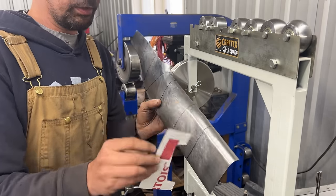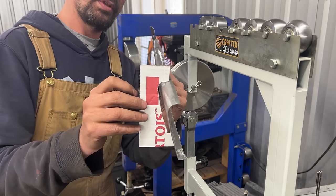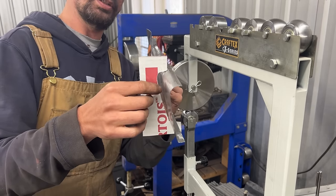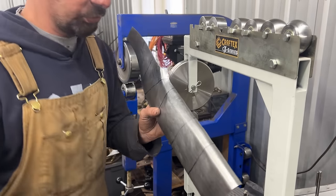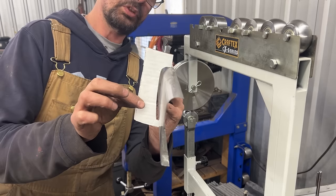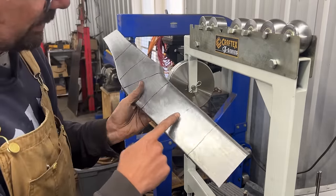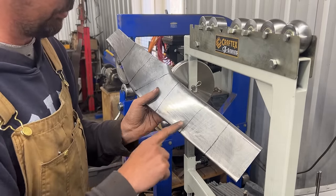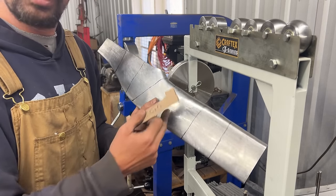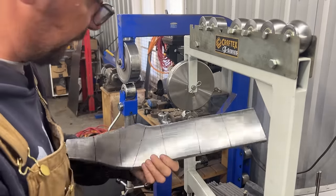But that's 8, we said, so that's here. But if you look even from a distance, the part and the gauge are pretty parallel here in this part. But then we go to 7, and look what's going on with 7. Not that parallel anymore. But the problem is not at 7 and not at 6, the problem is in between them. I don't have a gauge there. We can always make another gauge, 6A for example. The other ones fit pretty well.